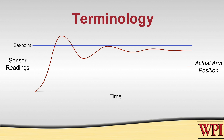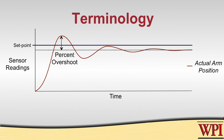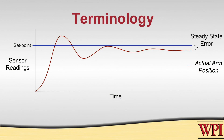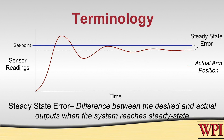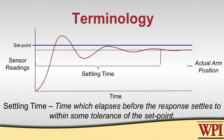There are many ways to do control, so how do we quantify which way is good? There's a bunch of things that people look at to determine if a controller is good. The first is called rise time — basically the time it takes for the output to rise from 10% to 90% of your desired output. Percent overshoot is how much you're going past your desired output, so in the case of a robot arm you might see it go past 90 degrees and then come back. Then there's steady-state error, meaning the system isn't getting exactly where it's supposed to be — you want 90 degrees but it only gets to 85.